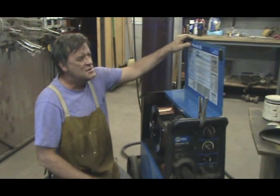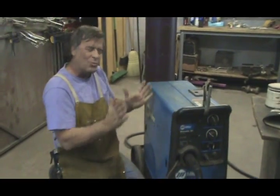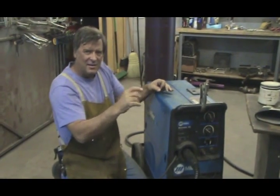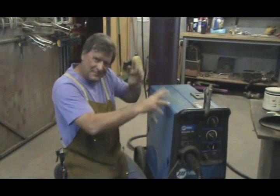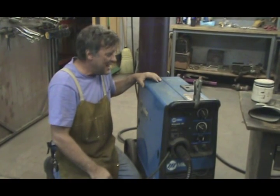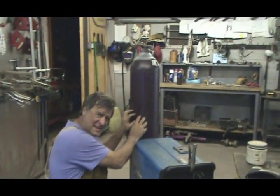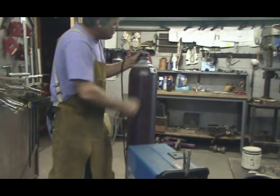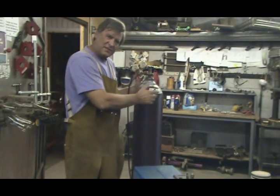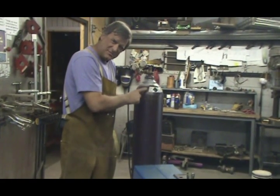But you don't look at that anymore, do you? Three or four times a day, actually, I do. If I'm doing a lot of MIG welding on one big project, I can normally set it and the settings stay where they are. But if I'm doing a little job here, a little job there — I haul it outside to fix a trailer hitch, take it out front to fix the fence — I'm playing with the knobs. A lot of times I'll look at that just to remind me. Now, this machine runs solid core wire, so I've got shielding gas in this big tank — argon and carbon dioxide. You can also run straight carbon dioxide, but it doesn't make as nice of a weld and doesn't give as much penetration, so the mixed gas works better.